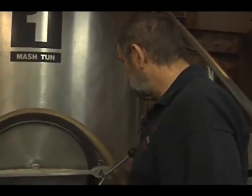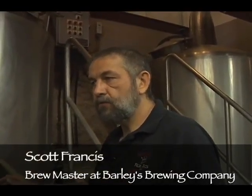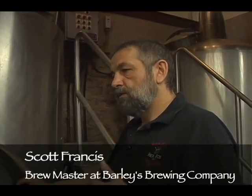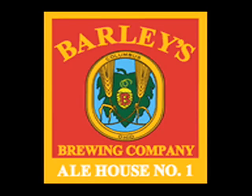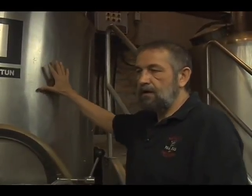What we have here is a typical 10-barrel brewery, and it's also a typical ale brewery. The difference between an ale brewery and a lager brewery is that in a mash tun, where you put the barley in and cook it, if you're doing a traditional style lager, you need to put the barley in at water that's one temperature and then slowly raise the temperature — you have to have the ability to change the heat inside this. In an ale brewery, you just dump it in at one temperature, and you can't control it once you dump it in.